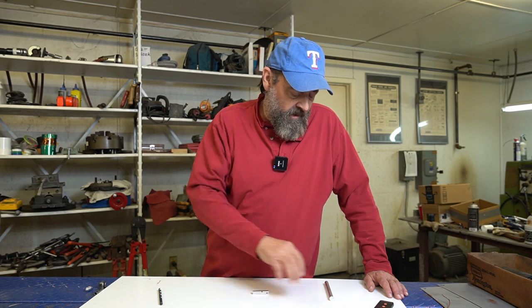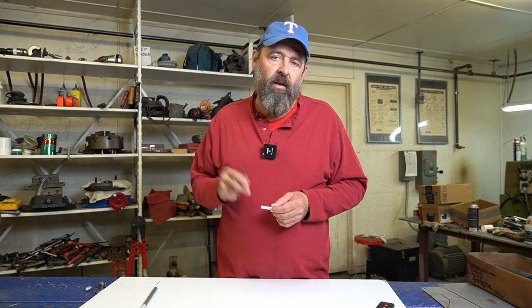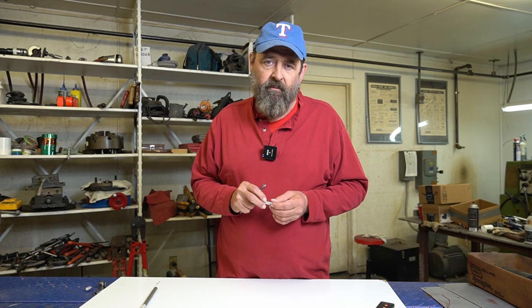If you want to check out some videos over all the modifications that I do to these guns, there'll be links at the end of this video. I'm just going to have a little montage, put some music behind it, and you guys can watch me make this. Like I said, I start off with a half inch piece of aluminum. I center drill it, then I drill it with a 21/64 drill — just to the end of this, you wouldn't want to drill all the way through. Then I turn the ODs down, part it off, go over to the mill, and that's where I do the holes.